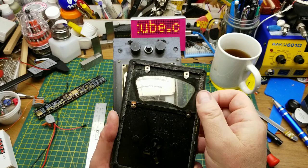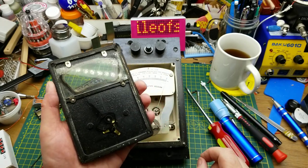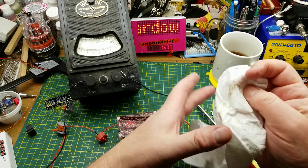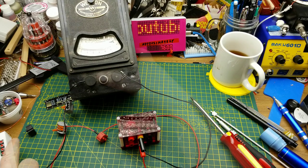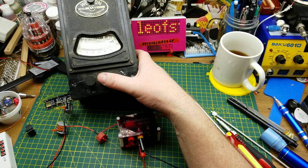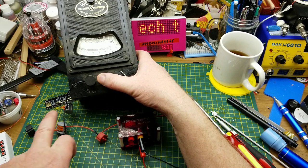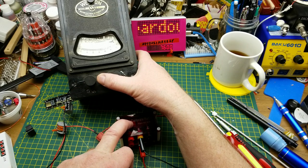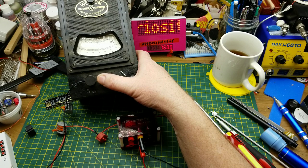Before I put this back together I'll get some glass cleaner, clean that little lens, and put it all back together. Now that's back together and the glass is cleaned. I've re-established my little test rig — I'll turn that on again and let the meter settle. It should settle near 30 if it's repeatable and I didn't knock it out of alignment. Now I'll take that resistor out of the circuit, measuring just this 180k, and bring my voltage down until we hit right on 30. Shifting my head around to take care of that parallax error — and there we are, bang on 30.